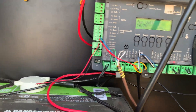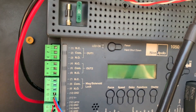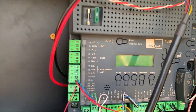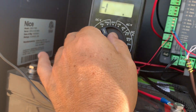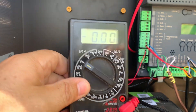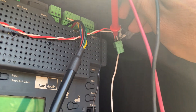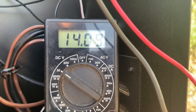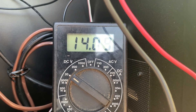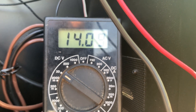You don't need the full 18 volts coming through all the time — you just need it a little bit higher than 12 volts. I'll double check it with my multimeter set to about 20 volts DC. With the multimeter touching the cables coming in from the solar panel, I can see a pretty consistent 14 volts. The board is taking about half a volt off, but 14 volts is pretty consistent.